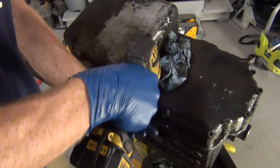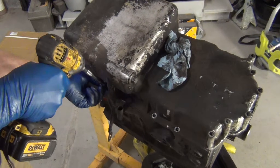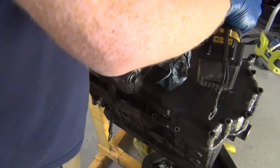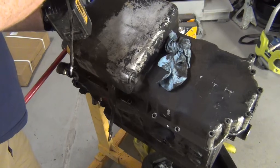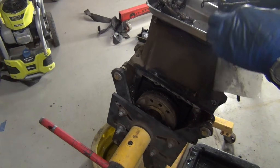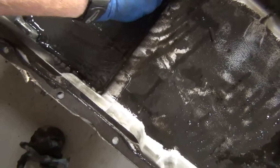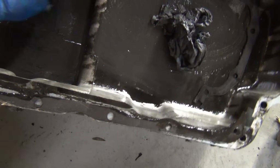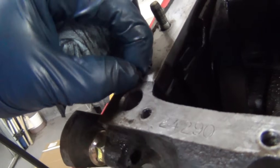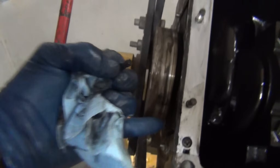The half-inch socket will just buzz through and grab the rest of these. I don't know what this is, but I should probably mark it — the one closest to the oil plug. Kind of a motley crew, isn't it? It's all mixed. I'm just going to take a rag and wipe through this sludge, whatever won't drain. So much auto repair is like being a dishwasher. I discovered what the little rubber plug was from — it's from the little gasket that goes to your rear bearing cap.